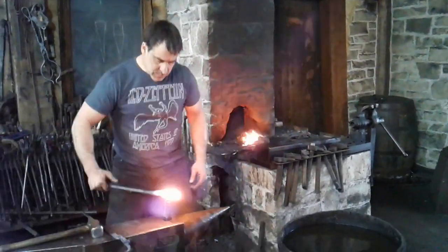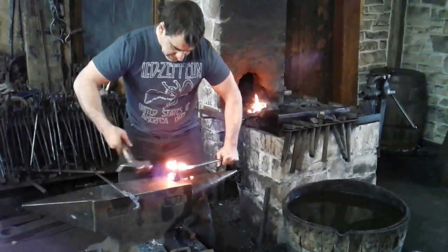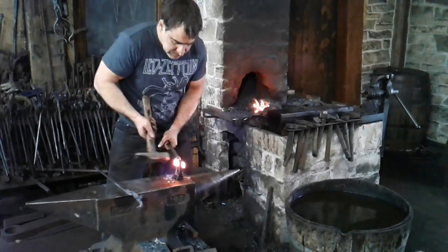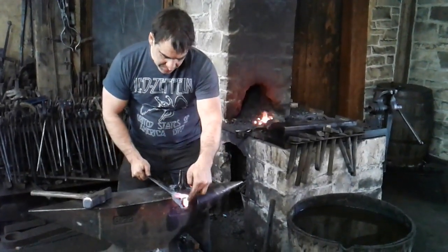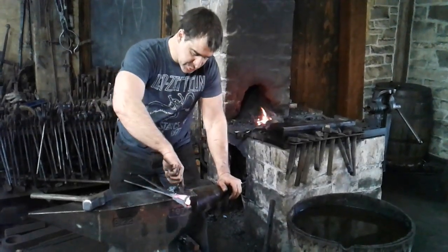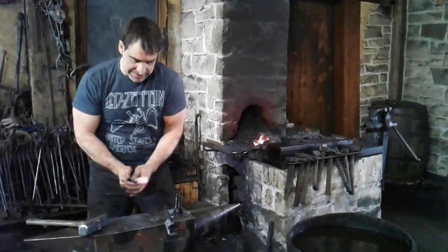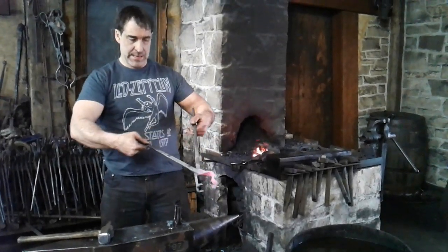Now I'm going to form the other jaw to close into the box. I'll bring it into my bending forks — another hardy tool — bend it up and then bend it back, then get into the forks and bring it around to create a little U shape. The idea is to bring this back to where it grabs but leave a little gap in there. For example, when working on a strap hinge with a rolled end, this gives you a little space to grab inside there. So this gives you a couple more options with the tongs. We'll let these cool off and then assemble — that is our box jaws.